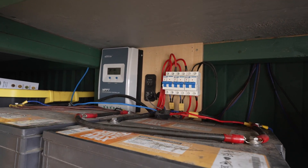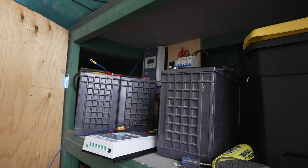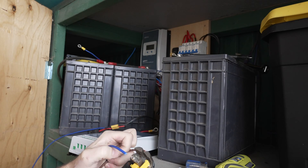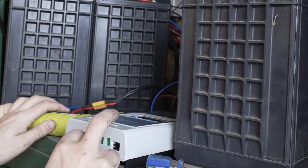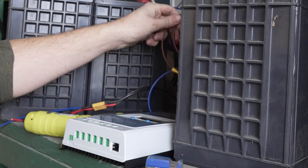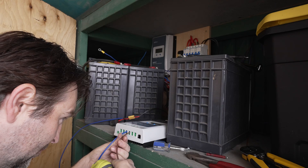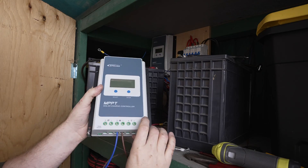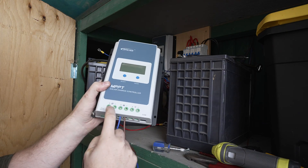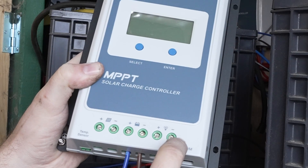The star of this setup is going to be the Power Queen 100 amp hour battery. A general rule when wiring stuff: you want to keep your solar panels as close as you can to the charge controller, and your charge controller as close as you can to the batteries — this helps minimize loss throughout the system. The other important thing: whatever charge controller you plan to use with lithium, make sure it is compatible with it. That basically means it has a higher charging voltage — I believe it's around 14.6 volts for my battery, which is fairly standard for lithium. This charge controller is fairly simple — it's an Amazon EPever MPPT, which maximizes the energy you get out of it. You've got your solar panel hookup — positive and negative — and your battery positive and negative.